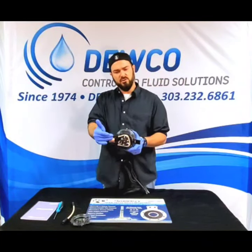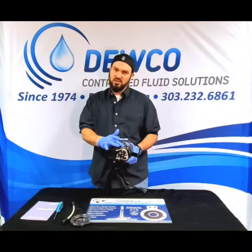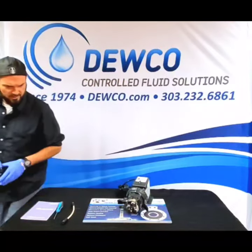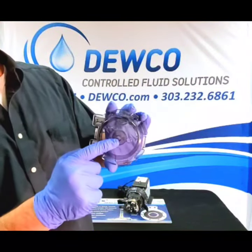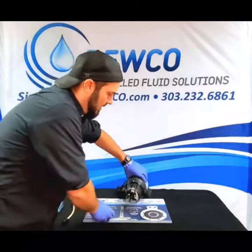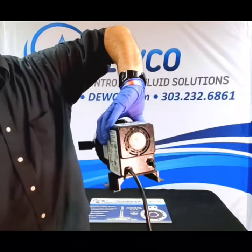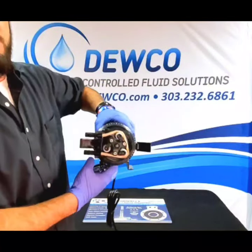Now we have the tube and the roller assembly, which is expanded — which is what you want for creating suction to positively displace the discharge from the suction side from your holding tank. Since it is expanded, this is the part people sometimes don't grasp right away. The housing cover has one hole in the middle and three holes in a triangular formation; these three holes marry up with the three bolts, and the middle one is for the shaft. Make sure the fan is obstructed, because if it isn't, the pump drive will just spin and you won't be able to collapse or expand the roller assembly.